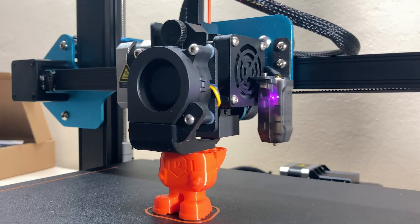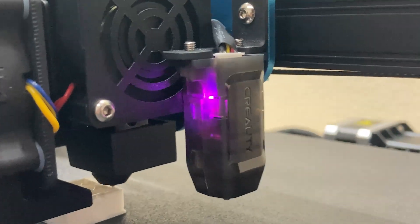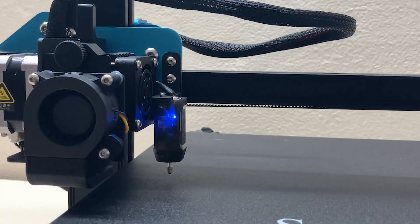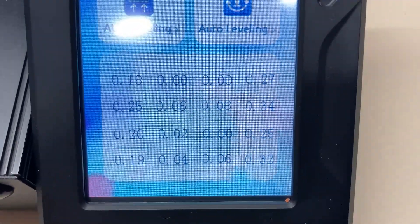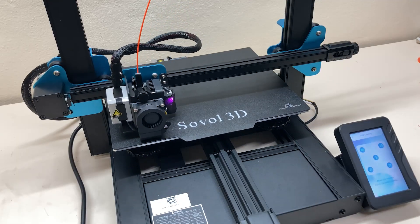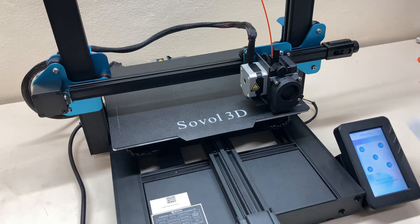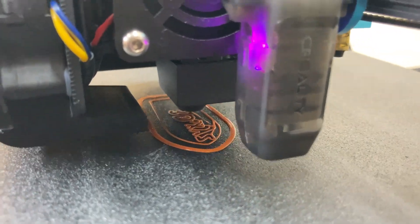One of the most distinctive things on the print head is this CR Touch leveling probe — yes, this is the Creality-branded CR Touch. This probe is quite good and reliable; it measures from 16 different points for automatic bed leveling. You can even see these measurements on the screen interface. The printer also has bed springs — I do first manual leveling from the corners with a paper, then start automatic bed leveling. With this probe, bed springs, and magnetic surface, getting a perfect first layer is quite easy.